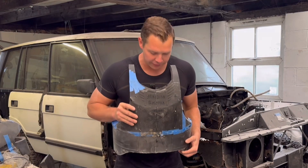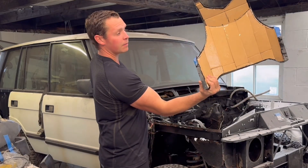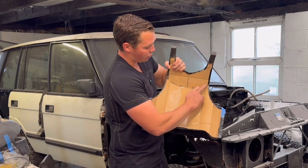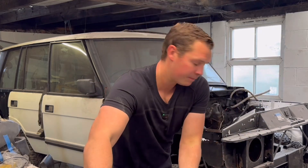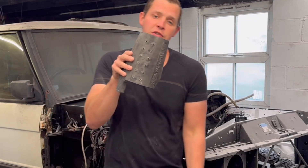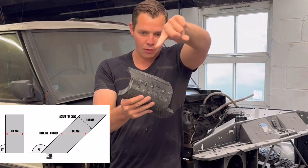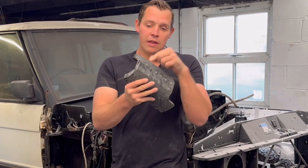And there we have it - we've got the chest piece done, it does fit pretty well. We've got the ceramic laid in the back and it's also not too heavy. Of course there are still the steel plates to line on the inside, and then there'll be an extra plate that goes on the inside for added protection. That will also help make sure there are overlapping pieces covered, and there'll be an extra overlapping piece for the ridge line. And then we've got those forearm pieces complete - both have come out pretty well with a rubbery finish on the inside, with those nut inserts showing nicely for good attachment points. If you imagine your arm up like that, you'll actually have an increased amount of ceramic at certain angles - if a round came in at that diagonal angle, you're going to have a lot more than 14 millimeters of ceramic, more likely over an inch.